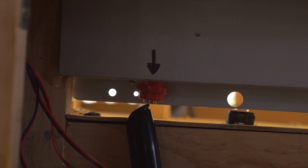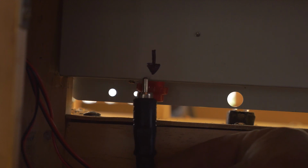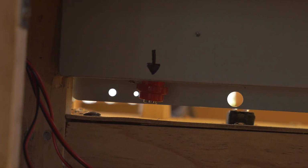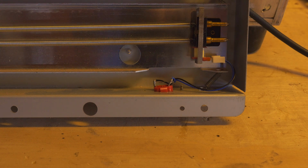So let's have a look at the back of the Reverb Tank. We've got this plug that comes out. It's a red, so you have a red and a white, and the red one's the one that we're interested in. However, the plug, as you can see, because of the framing, it rubs. It doesn't allow us to actually insert it properly. So there's two options to fix that. One option is we can sand it or use a chisel to chisel that part out. But the second option is to remove a button. So let's do that one.